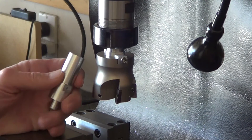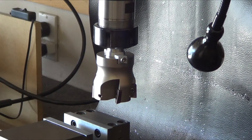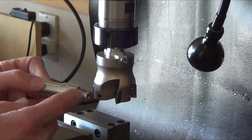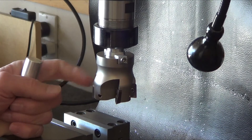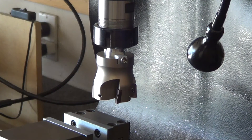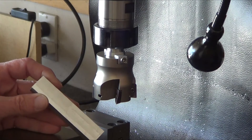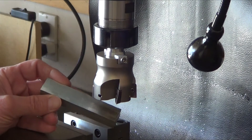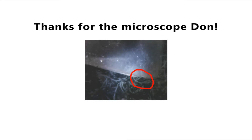I made that first arbor, did some turning, and the finish was just awful. I checked it on the granite surface plate and found runout on it, so I made a second, really precise one - turned the shank, shoulder, and body all in one piece then cut it off, finished the face, and it's pressed in with zero runout. I ran the surface again and still got a total mess. Looking at the result under the eye loupe, it's the weirdest patterns I've ever seen. Turns out every single insert has a chip in it.